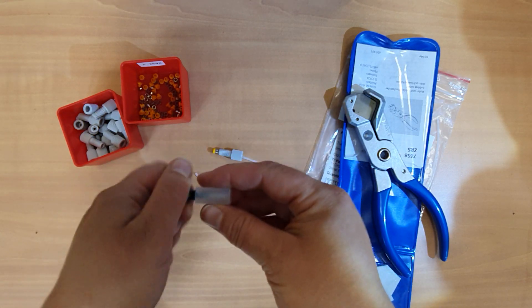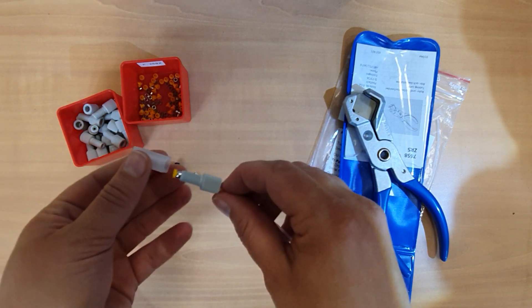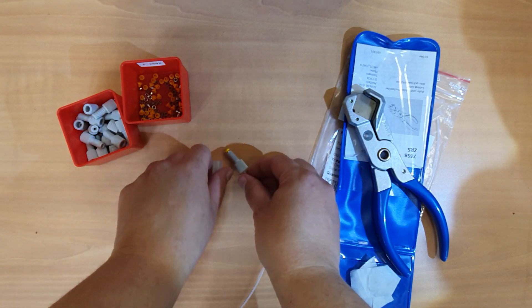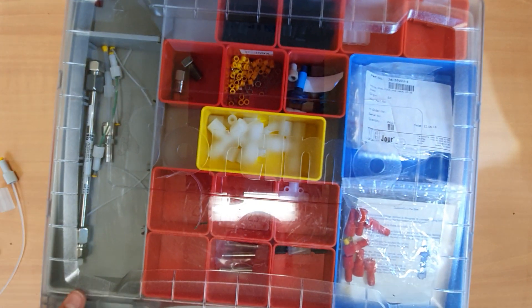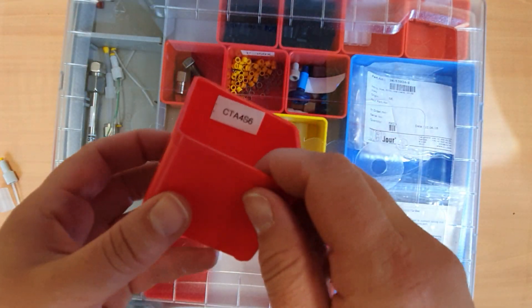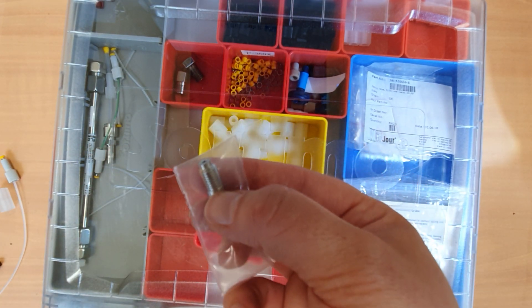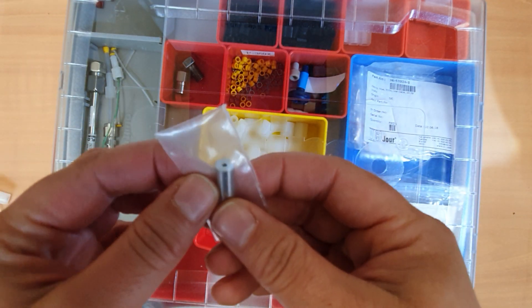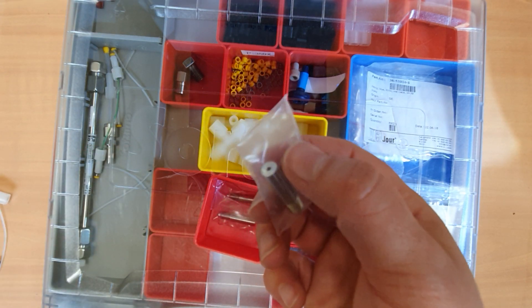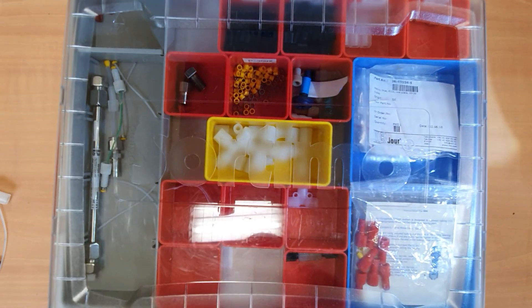If you want to connect two pieces of tubing, you can use one of these connector pieces and simply screw the two fittings together. Another common piece I use for connecting tubing is the Vici CTA4S6 — these are stainless steel pieces with a thread on one side. The flat side is a quarter of an inch, but if you talk to the workshop they can grind it down so that it fits into our six millimeter fittings, and then you can adapt this piece directly to the Swagelok fittings we commonly use.